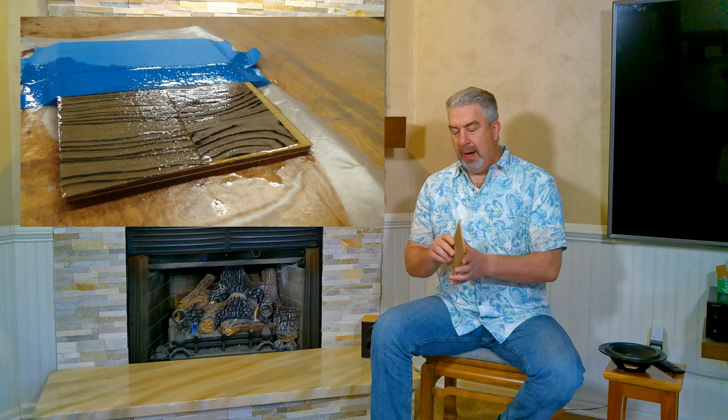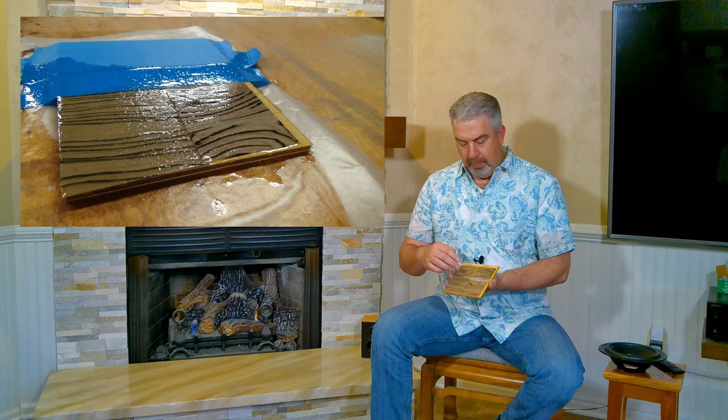Now, after I glued it to this board and applied a finish, this I applied the inside of the roll is facing out, and this the outside of the roll is facing out. And I applied poly to both of these and lacquer to both of these just to get an idea, just so I knew which side was facing out. Well, the inside of the roll is smooth. This is really rough. This is where the fleece backing is. But you almost can't tell by looking at it. It was really difficult. But at any rate, I had never used fleece backed veneer before.